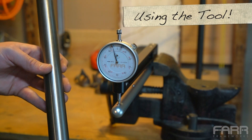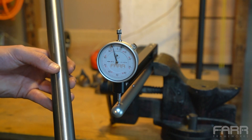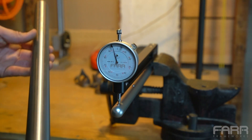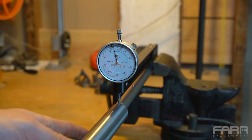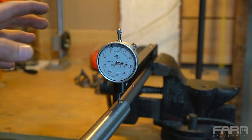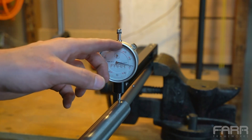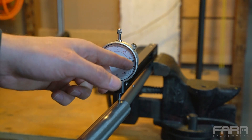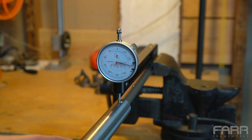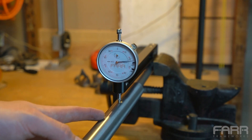Let's use the tool to find the butts on this particular tube. I bought this tube from a company called Bike Fab Supply — I'll put the link in the description below. I use a sharpie for this step so that I can mark the transitions on the outside of the tube to reference them later. You take the tube and slide it onto the tool. It'll take a little bit of force to get it to jump the dial initially, but once you're in it actually moves quite easily. Note that this is a reference only tool — we're looking for just the delta, so these values initially don't really mean anything. With the tube as parallel as possible to the tool, slide it in slowly — we're looking for big changes on the dial. We found the butt.